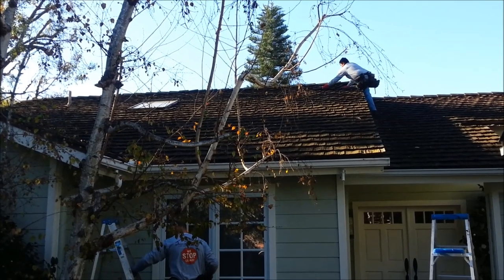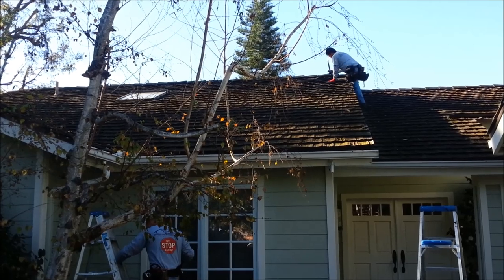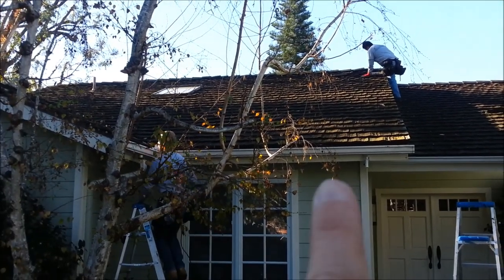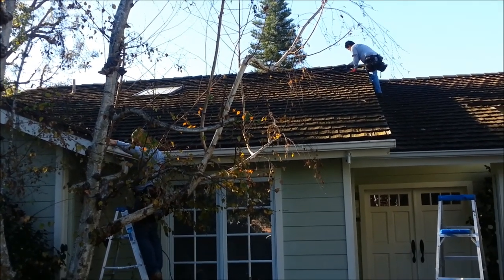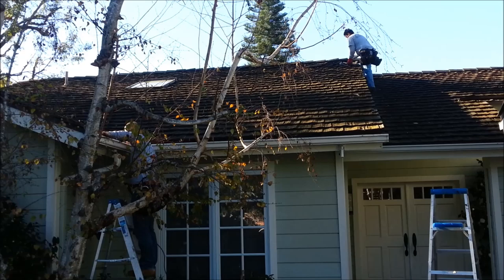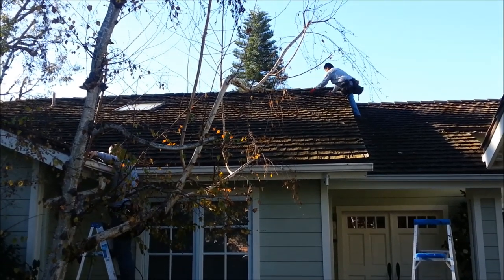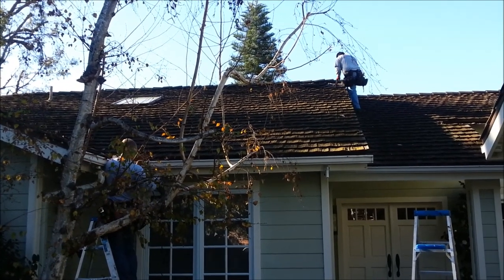Underneath the roof, there's a plywood deck. So the plywood deck is nailed into the fascia every 6 inches. A lot of people try to just tear the fascia down all by itself without taking apart the roof. Then you have to clip all those nails. And once you clip all the nails, the edge of the roof is left unsecured and it's weakened. And on top of that, it's just not good waterproofing. You're probably going to get leaks in this area.